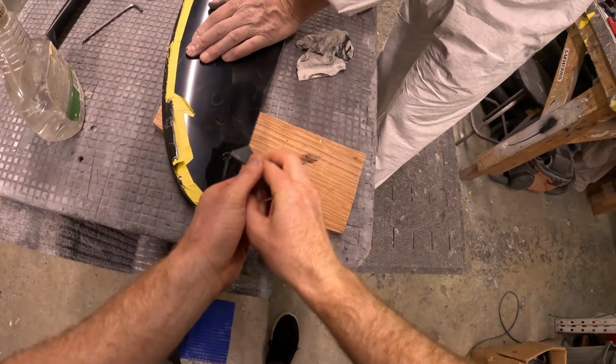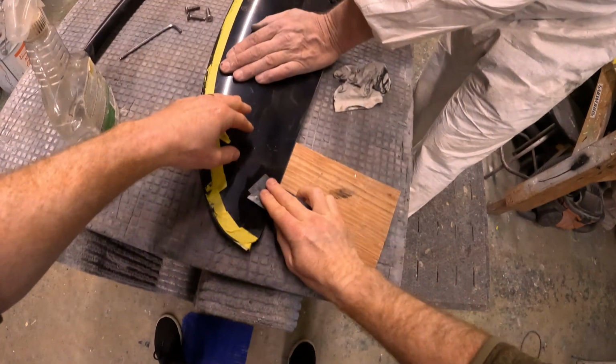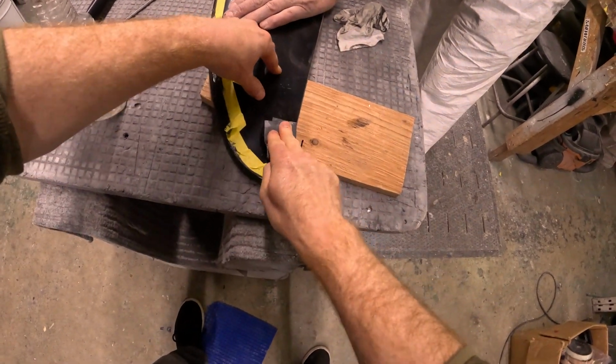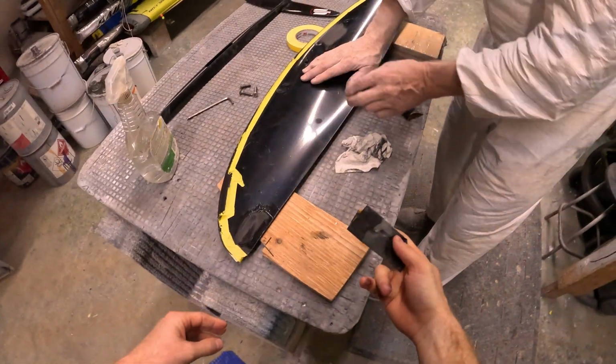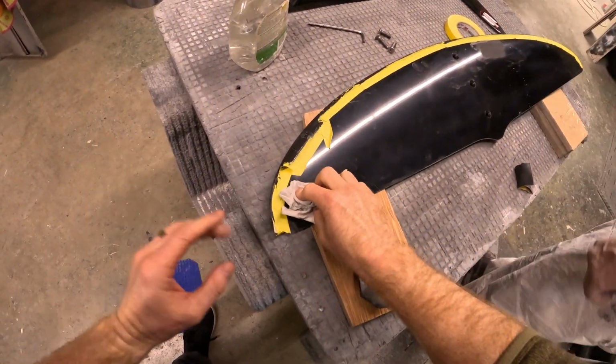With the 600, you basically want to make sure that you get all the bumps out. Once you've done that, you can move up to the 1000 grit and get an even smoother finish. With wet sandpaper, you're always adding water to make sure that it cleans the excess material and prevents the sandpaper from getting clumps of glue and material stuck to it.